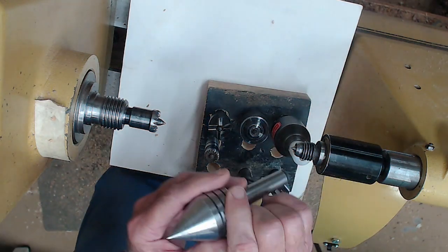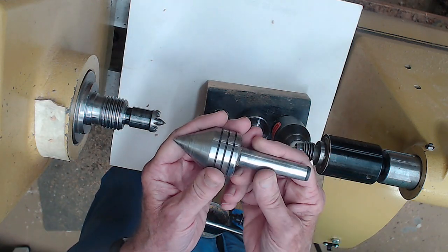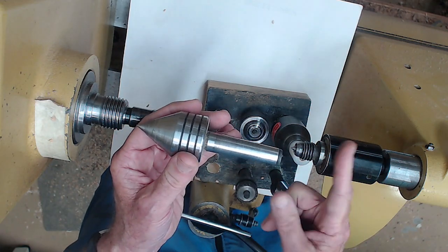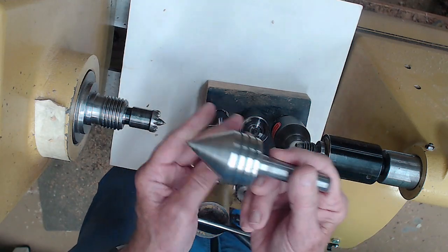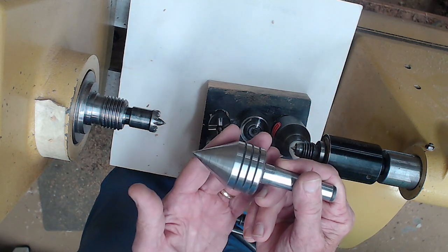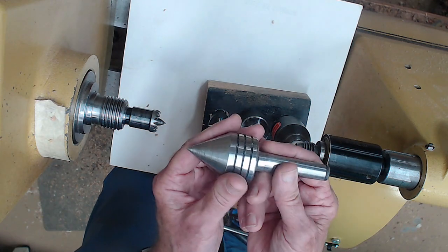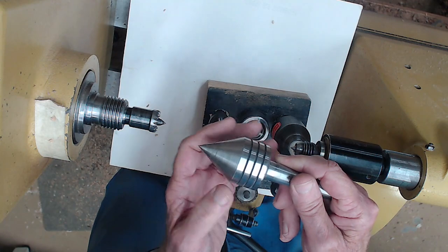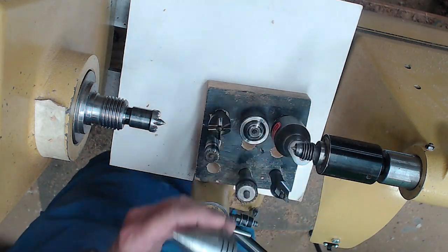When it comes to a 60-degree cone, one alternative is buying an inexpensive Chinese one. It only has about one bearing, whereas the nicer ones have a couple of bearings, so they hold up better long term. That said, I've been using this one for over 12 years and it's running just fine. So anytime I need a 60-degree cone, I generally get this cheap one. In the United States, these sell for somewhere around $18 or $19 on Amazon or some of the various woodturning vendors.